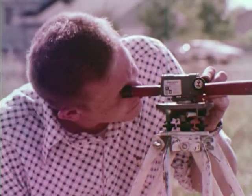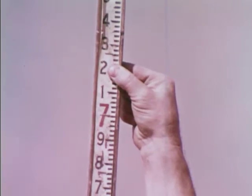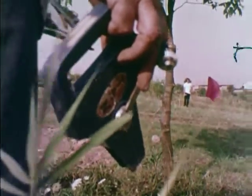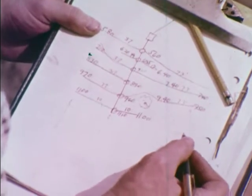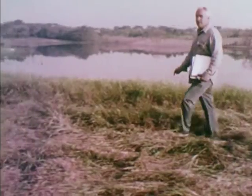The elevation of the second line is shot — seven foot two is read and recorded. Each line is laid out and measured. A new plot plan is prepared showing all elevations and lengths of lines, and a copy of this plot plan is used for the permanent record.